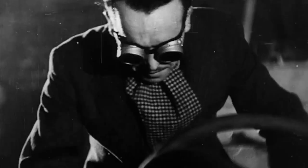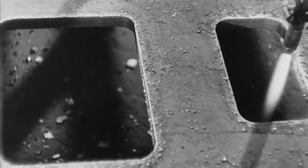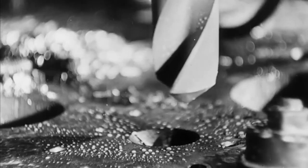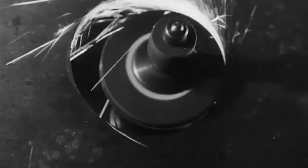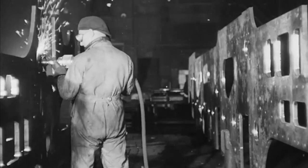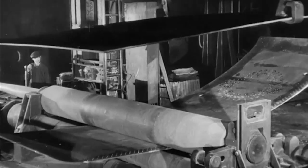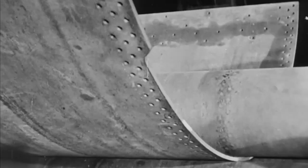To make the frame or chassis on which an engine stands, thick steel plate is cut by oxy-acetylene burners, shaped and drilled. While the sides of the frame are being burnished and finished off, other flat steel plates are bent by the pressure of hydraulic rollers, slowly curved to form the circular boiler plates.